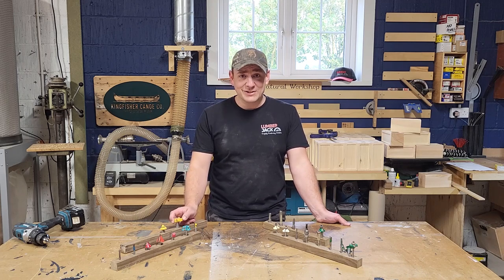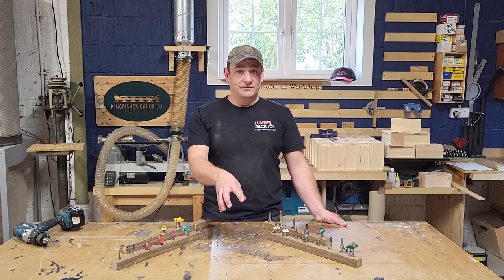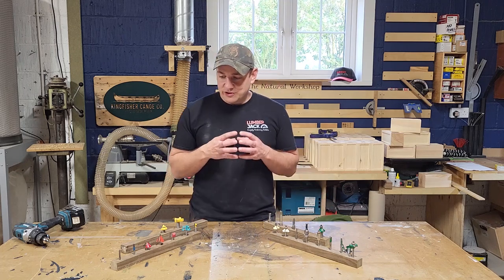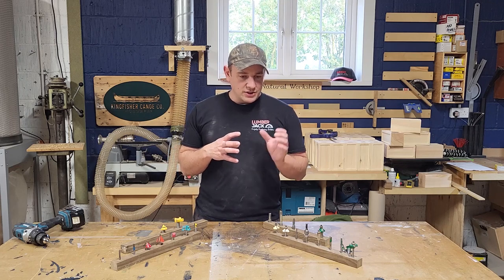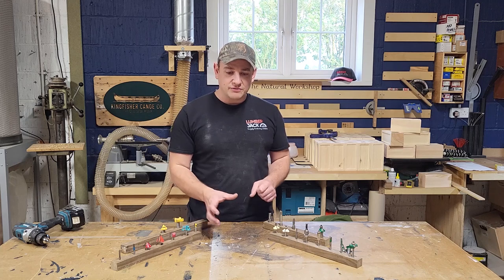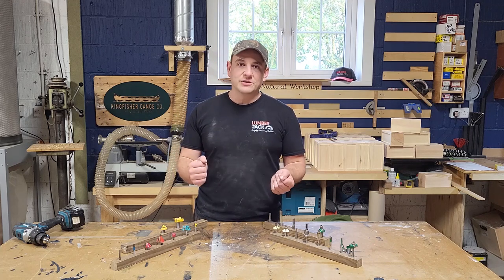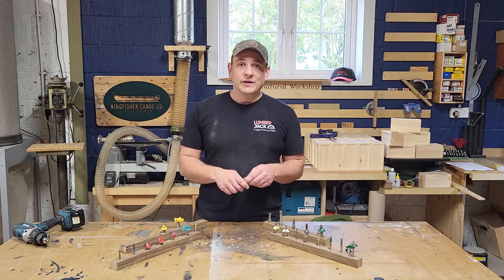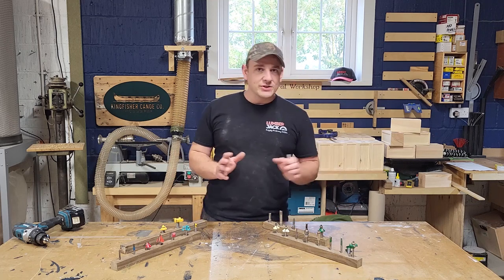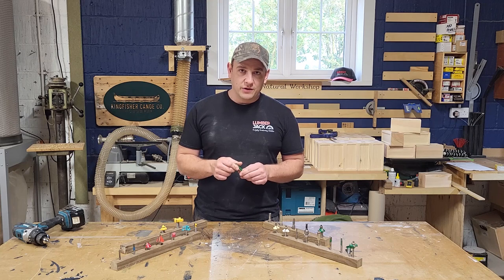What I personally think you should do is get a good quality quarter-inch router and a good quality half-inch router. Then when you're going to do pattern work or hogging out loads of material, get yourself a half-inch bit. It can be one of these cheap ones, a Trend, Excalibur, or a Whiteside — whatever you want to spend your money on. But go half-inch if there's going to be a lot of force on it.